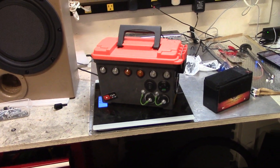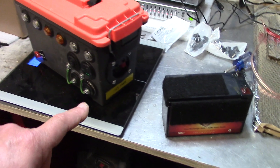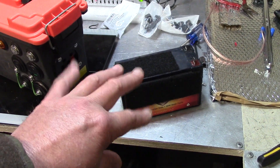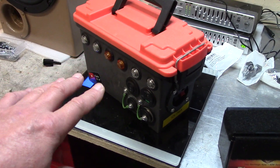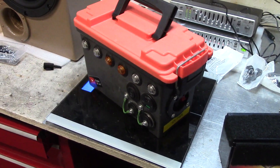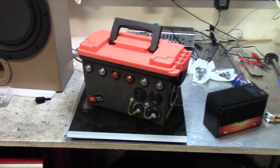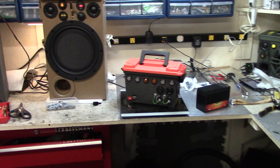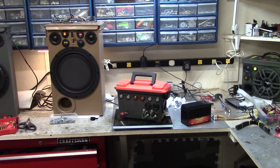What's great with these lithium batteries is that they're smart — SLA batteries don't have a BMS, whereas lithium batteries have a battery management system. So you can't overcharge it, you can't over-current it — it's all protected.